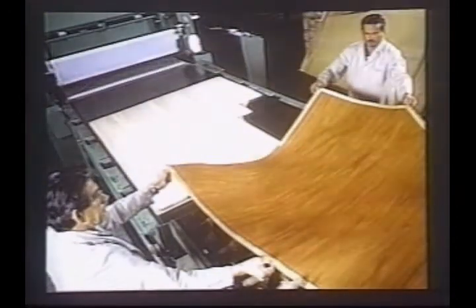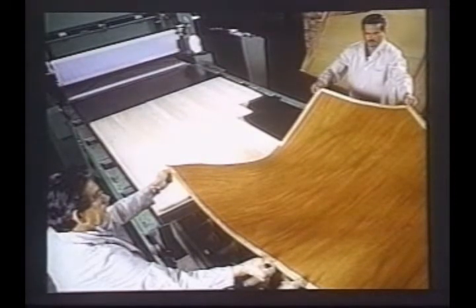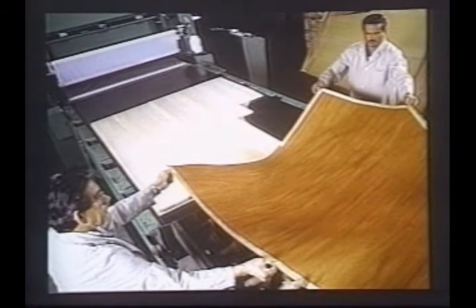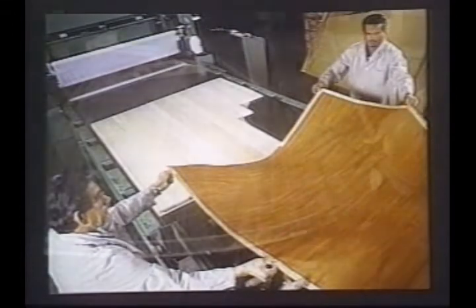In another part of the building, we veneer the grand tops. The core is double veneered on both sides in a cross-grained pattern. The core has grains running straight from front to back. This 5-ply construction makes a flat surface that stays flat. This is also true of the vertical top and sides. All Steinway flat case parts are made of 5-ply construction.